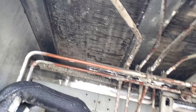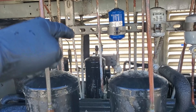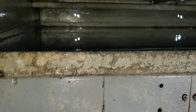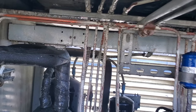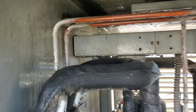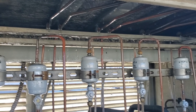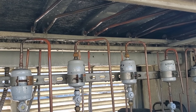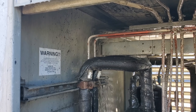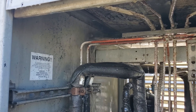Rinse the condenser — it's looking pretty good. Still a little bit left to go, but I've got to point out the biggest flaw in this rack. Remember the catch pan — that catch pan prevents the water from falling onto all the electrical components of the compressors. All that lint that I washed out is in that catch pan, so when that water evaporates and dries up, all that lint goes right back up onto the condenser. See that drain hole? It's plugged up. The catch pan is full of water right now because the lint is plugging it. You've got to make sure you look at the big picture — clean that lint out of there, clean that catch pan, and then the condenser won't get as dirty as fast. All that lint and gunk is coming out — it's going to be almost impossible to get it all out, but I'm going to do my best.